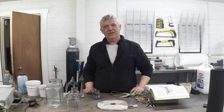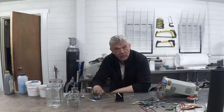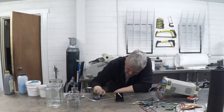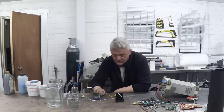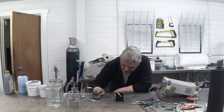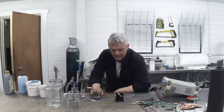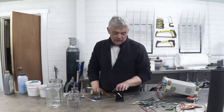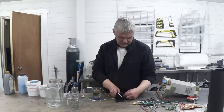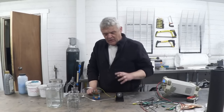After 15 minutes you can quite clearly see the separation — which is why it's called a gravity battery. Everything is held in place just by gravity. You can see the copper sulphate at the bottom, and the solution above, which was quite blue when we added the zinc sulphate, is already clearing up. There's the oil cap on top, the zinc just below the oil, and our S-shaped copper at the bottom. To show that this works, I've got a little motor here on a black background with a white propeller — connecting that up — and there we go, our little motor is spinning.